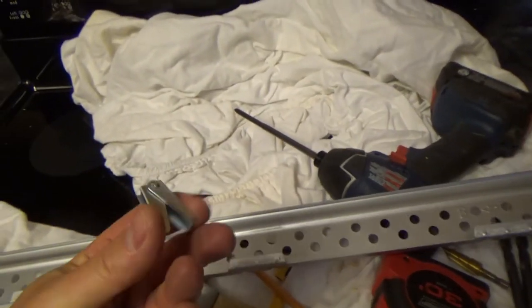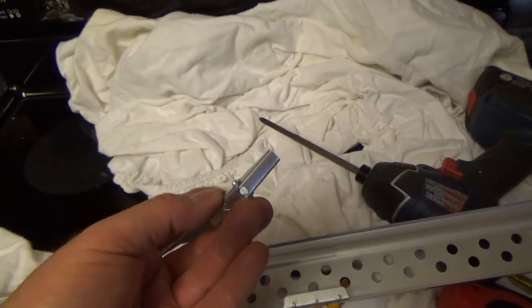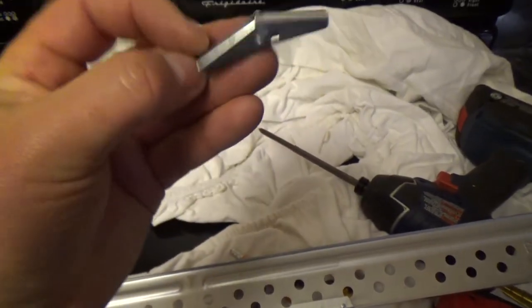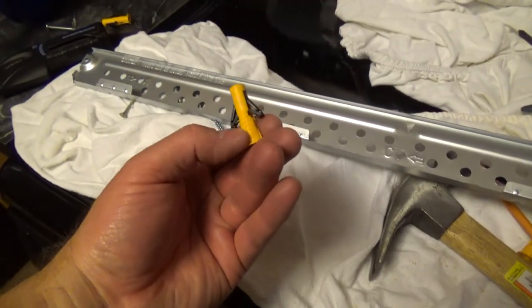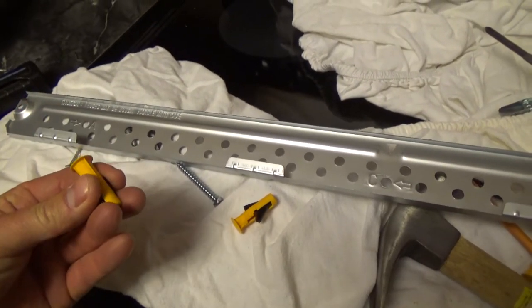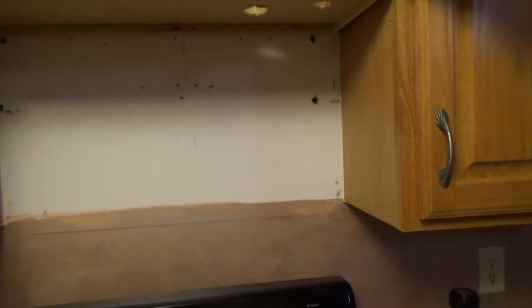Samsung supplies this kind of setup, which would require pre-drilling a hole about half an inch in diameter to make it fit through. Instead, I have these nice neat-looking plugs I'll be using. It's only a 5/16-inch hole and it's going to look nicer. The previous installer tried to do the same thing and left huge holes. So the next step is to install plugs, install the bracket, and finalize this installation.